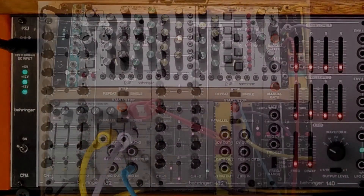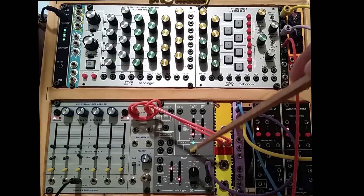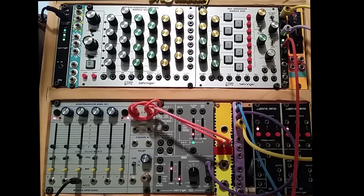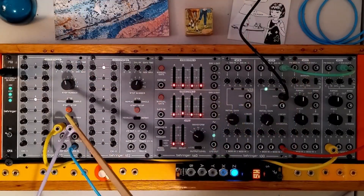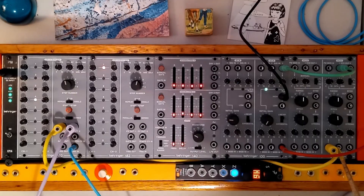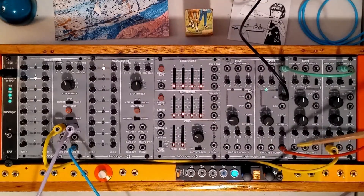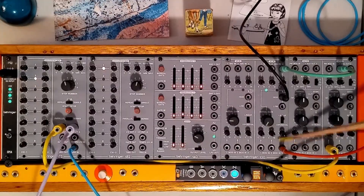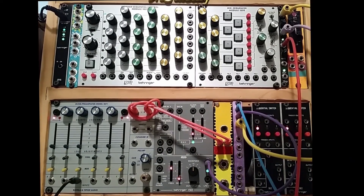You can make this as elaborate as you like — your clock can be a Darktime, PAMS, or whatever; we're just using an LFO here because it's simple and it's right here. A multiple and a clock divider/multiplier, and the rate CV in is labeled here — it's coming from channel 2 of the 182, and channel 1 is your note CV which feeds the oscillator. The oscillator feeds the VCA, the clock multiplier out controls the gate on the VCA, and into the mixer out to the computer. Pretty cool, I like it a lot — hope that helps.